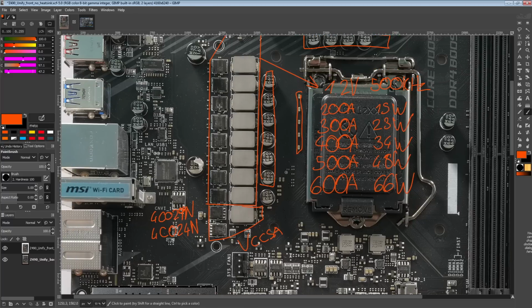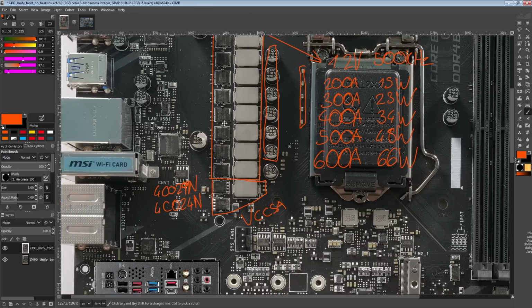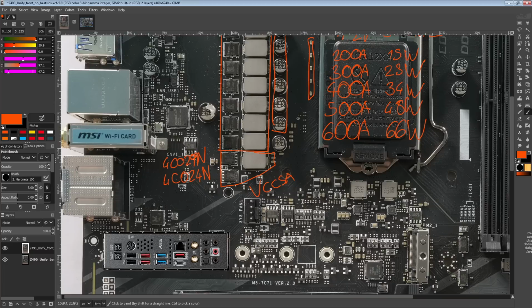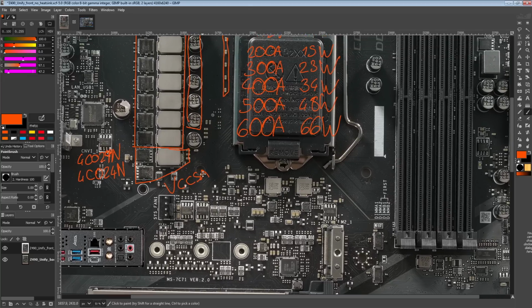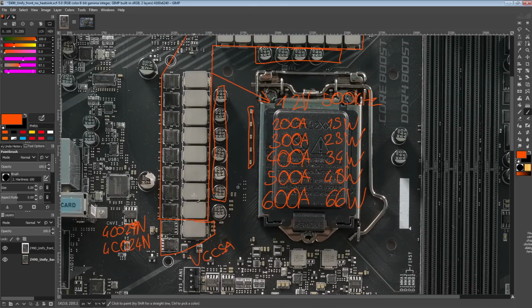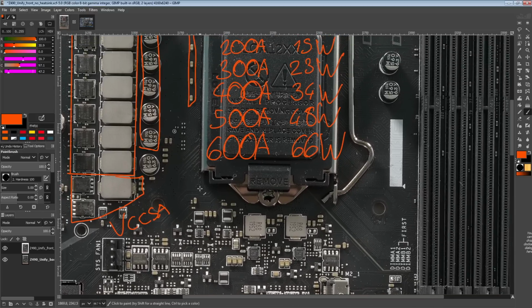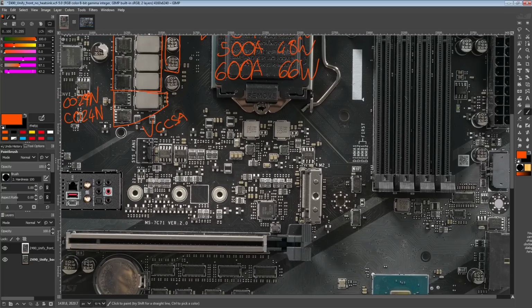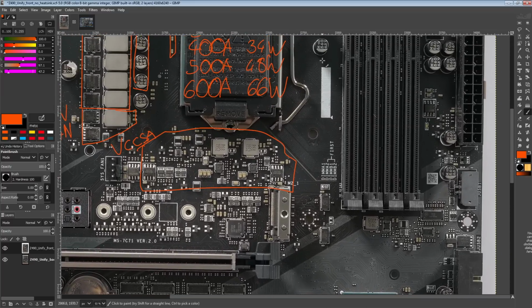In fact, this is more than fine. And plus, it gets to share the massive VRM heatsink that is here for the VCore VRM that's not actually going to be using it. So this is going to have more than enough cooling, even though VCCSA isn't a high-power rail either. So, basically, the VRM power handling capacity here is plentiful. Interestingly enough, VCCSA has a lot of multi-layer ceramics on it. Funny how that works. Anyway, then we've got all of these voltage regulators down here for the various minor rails like the PLLs and VCCIO, so, various voltages for extreme overclocking.